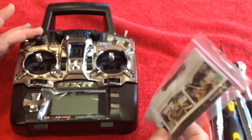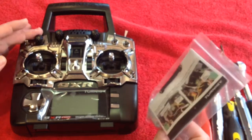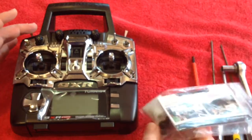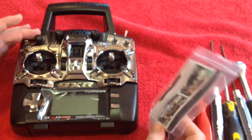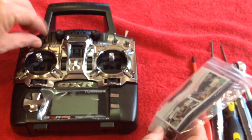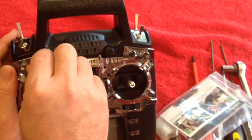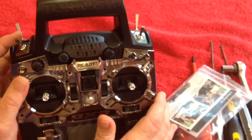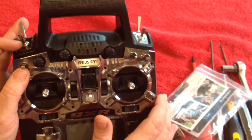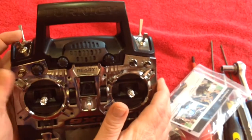These really come into vogue with quadcopters where you can use these switches to select your flight mode. But for us tankers using ASP, this 6 position switch will allow you to select one of the 6 sound banks that you have on ASP. You will be able to click through the 6 sound banks and when you get the sound bank you require you just flick the switch and that will play whatever is in that sound bank. So you select your bank, play the sound.